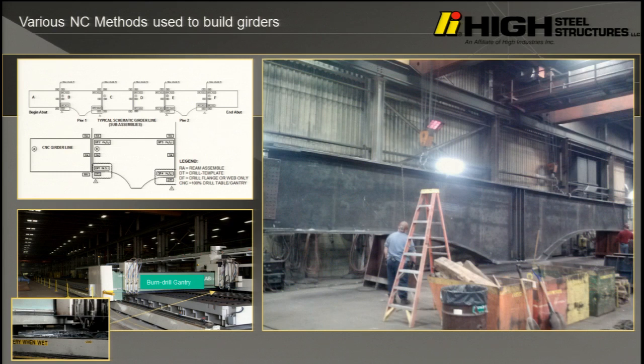So it's very hazardous. So now we drill a lot of full-size holes. We, the fabricators, do not want to have to build this bridge twice for free. So it behooves us to hold a tighter fabrication tolerance whenever we use full-size holes. You can read about how this bridge was assembled in the paper, but basically we used a gantry and we actually used subsize holes because we had to trial load it, but we wanted to try out some new equipment. So here's one of our gantries running, and it can actually drill full-size holes or subsize holes.